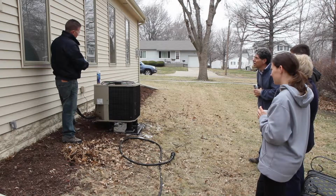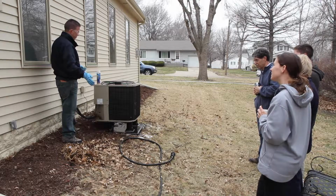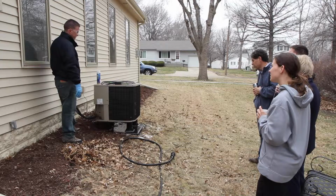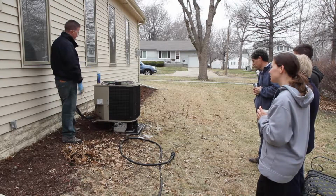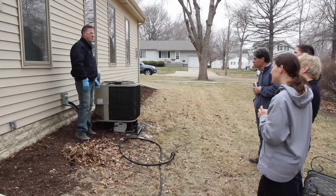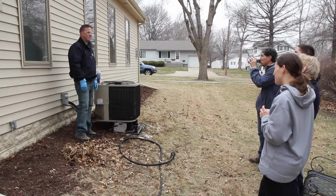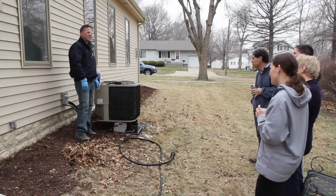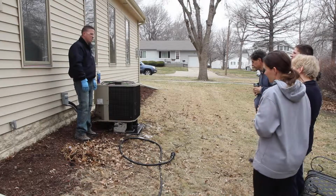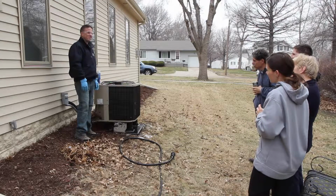We learned so far that first you need to put the spray on, and then we are able to spray it off almost instantly as soon as it foams, and then just dilute it off of the bottom of the air conditioner here. So finally, what we've learned here today is that you can save money by just coming out here and cleaning your air conditioner. So next time you find your air conditioning bills a little too high, too much to stomach, I hope you'll grab your hose and some cleaner and come out here and do what I showed you here today.